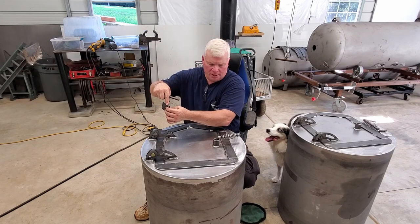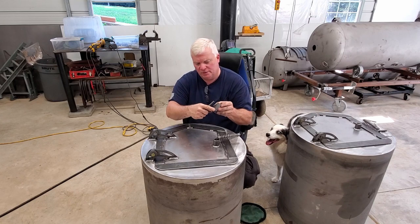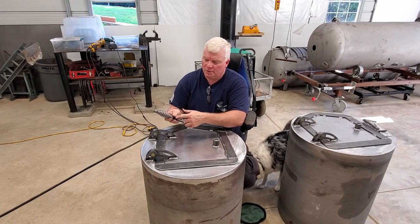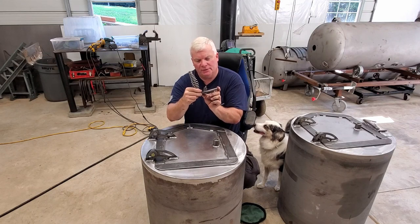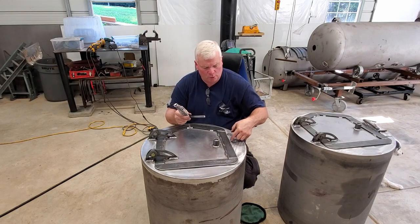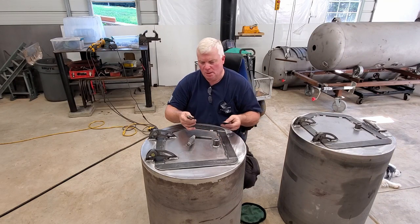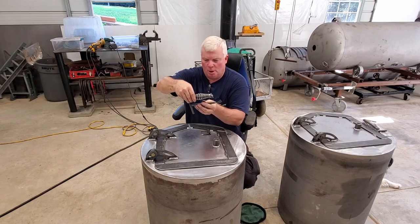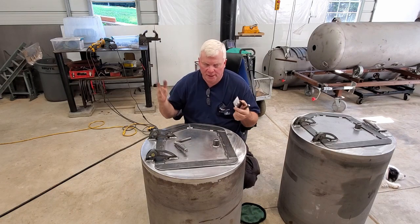I like having the quarter-inch material back there. It gets the pin a little bit further away from that face. You don't have to do that — you can mount just a piece of flat bar or round stock. We will cut this shaft off depending on how thick our door is. Some doors will be insulated, so you'll need more of the shaft, which is why the shaft is that long. On this cooker we'll end up cutting it off about right there. You could use that piece tacked or welded to the inside to act as the stop.